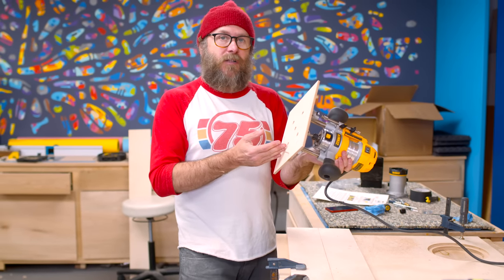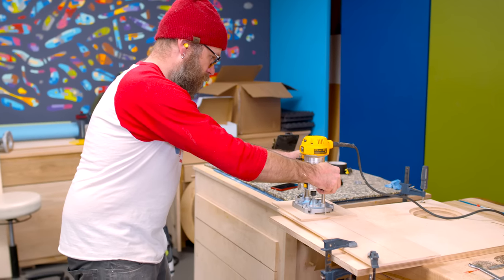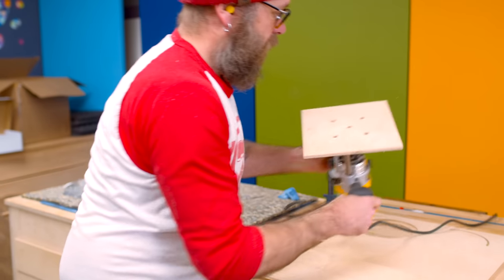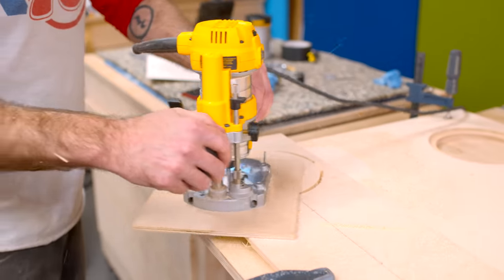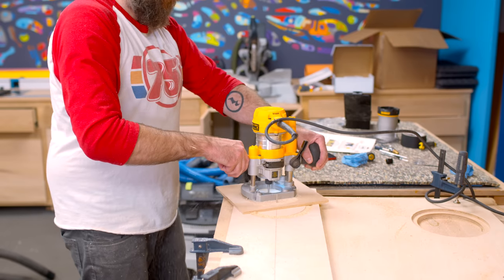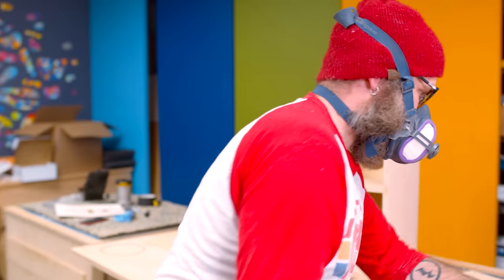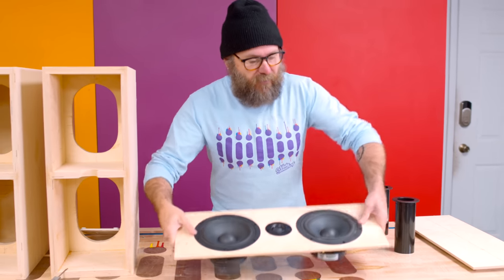I'm not going to show how I made the jig — there are plenty of videos on YouTube, and that's an entirely different video. Otherwise, just go ahead and use your CNC. Now I actually have to move it in and do another pass to make that rabbet even bigger — I've got that marked as step two. Now that the rabbet is cut, I move it to the next position and cut all the way through, which takes a couple of passes since this is three-quarter inch thick. Now it should just go right into place.